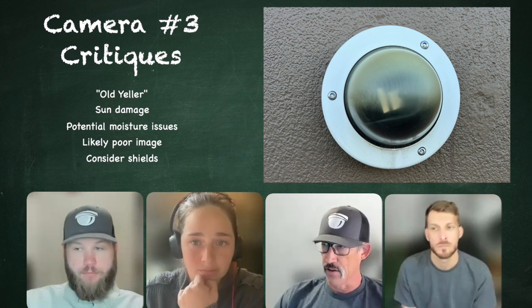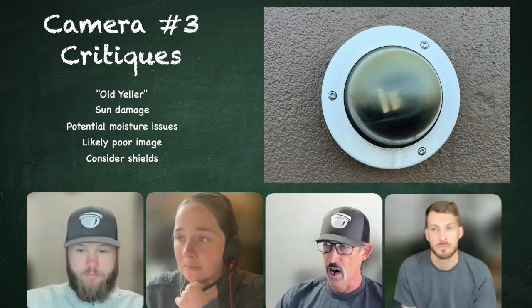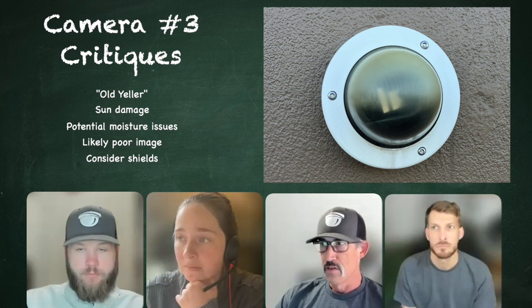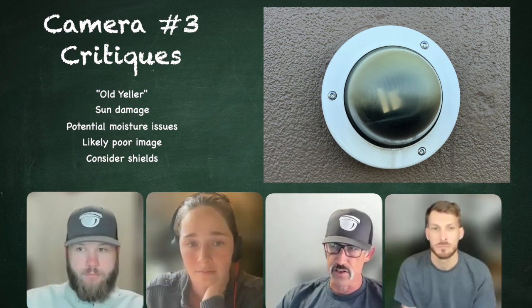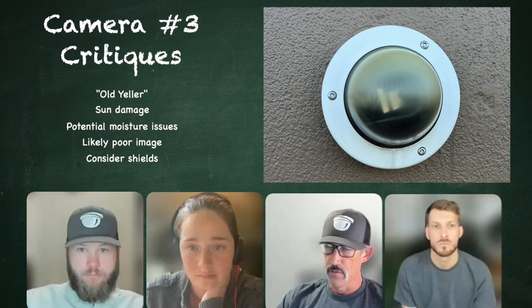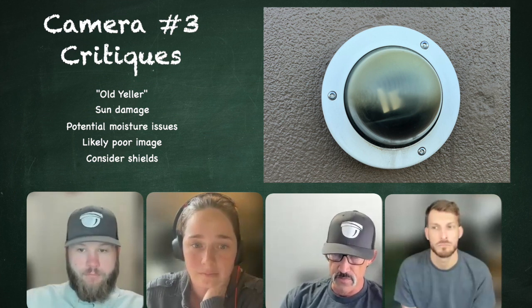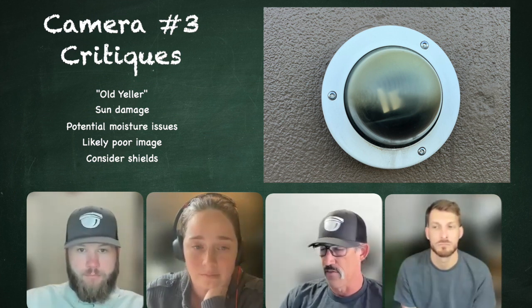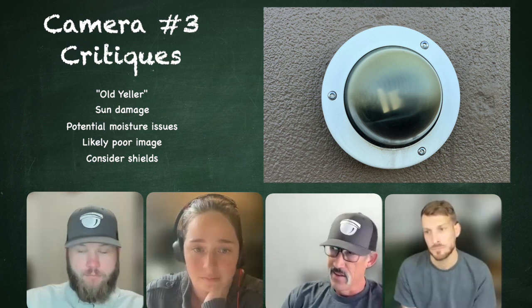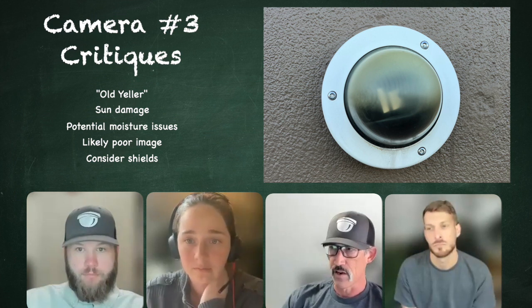Well, that particular one's not installed badly. I mean, the wire's coming in straight from the back. They've had to use no conduit or anything, so that's fine. If you're insistent on using a dome with a dome bubble, I think the only way you get away from that is if you put it on a wall mount, so it's facing downward. Of course, then you're taking on the risk of vandalism, because anytime you have a mount on a wall, it can be pulled down. But in essence, most of the time it's not. So if that's a concern of yours, I'd do that if they've already bought the dome bubbles. But I just wouldn't use a dome. I would either use a turret or a bullet camera.